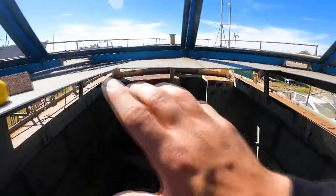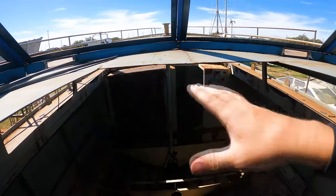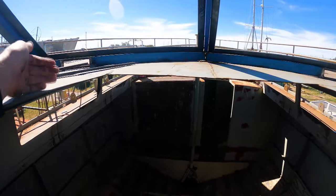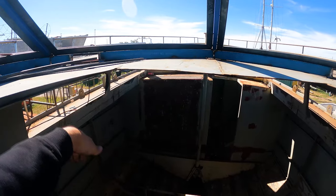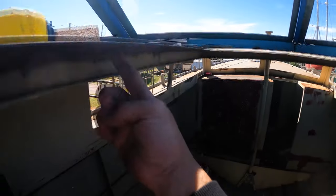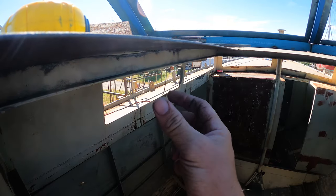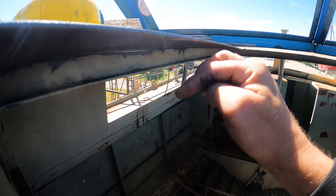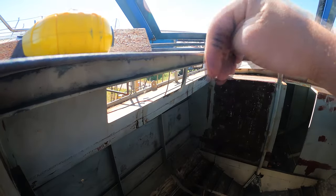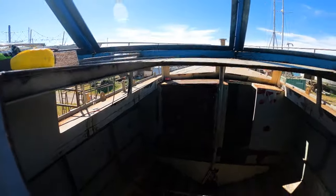We're going to be having a companionway that's going to slide into a cavity slide. So there are pros and cons about doing that. It just looks neater. The con is that water basically can come in and into your boat. If it was raised up, it protects it a lot better. However, I'm going to have a bit come down and an L bracket come in and down. Inside that L bracket there will be a bit of a copper dam so that the water can come in, fall onto it, and then drain down the sides. So it goes straight into the bilge.